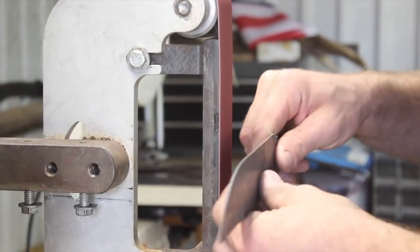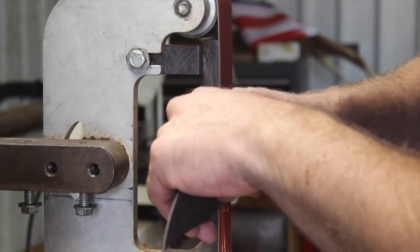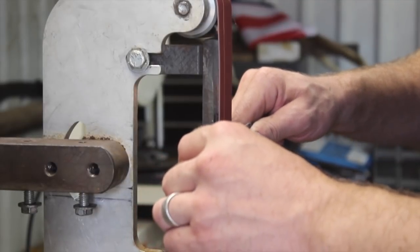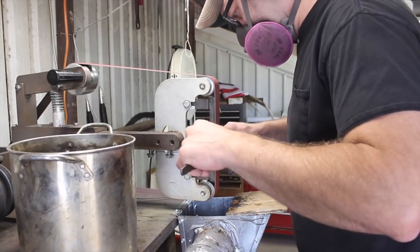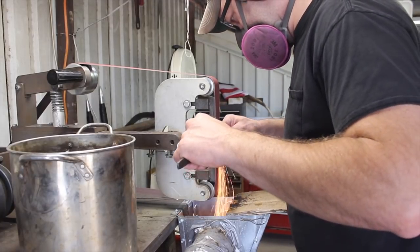Here I'm just putting a little bit of a radius right behind the plunge line, kind of cleaning that up. Now for finish grinding the blade — it's actually a little bit easier at times to grind hardened and tempered steel simply because the harder steel does not tend to grab, or catch, or wander as much on the grinding belt.